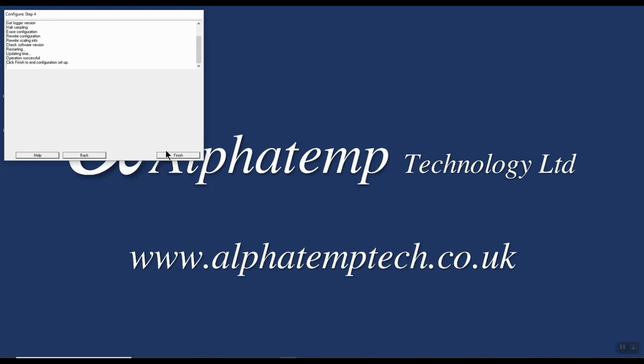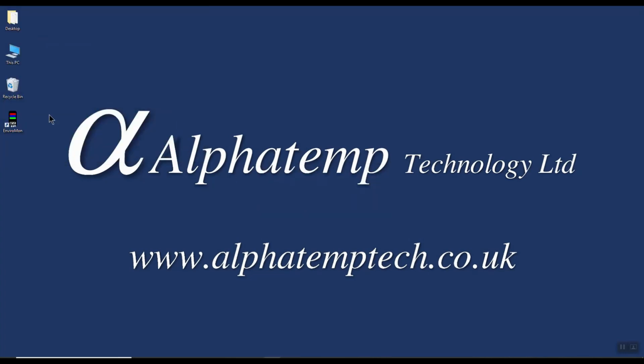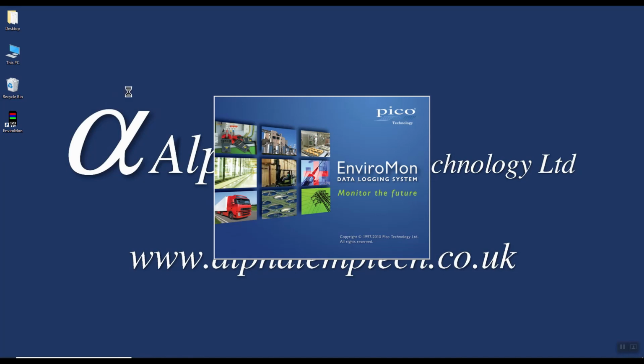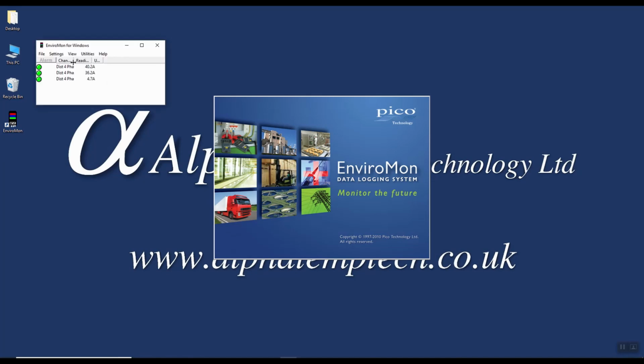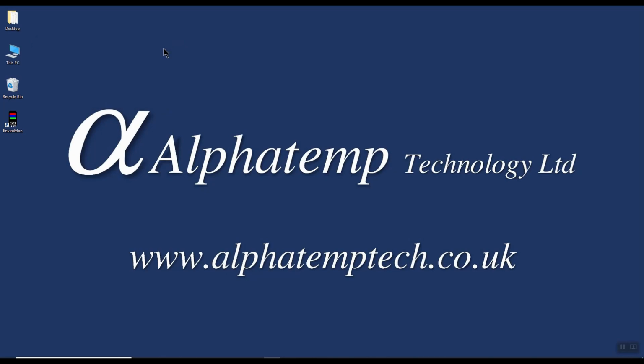So once it does that, we click on Finish, and it will ask us to exit for changes to take effect, and we can restart the software. And as you can see, we now have live readings. So we can now exit the software before we disconnect the data logger from the PC.